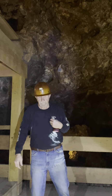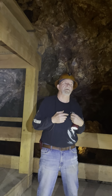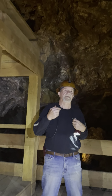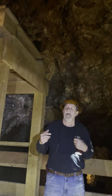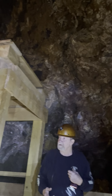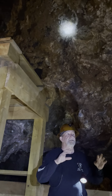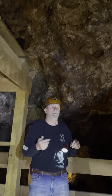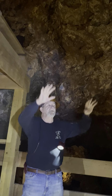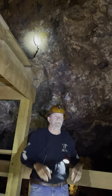And then that rake could go up over the ore pile and drag that ore out of there. Now, when I worked underground, the crosscut miner and the raise miner and the stope miner all worked together. What they do is they bring a diamond drill machine down into a tunnel. That diamond drill machine was a core drill machine, so they take core samples out of the drilling and they drill holes all out in different directions looking for an ore body like this.